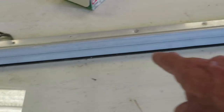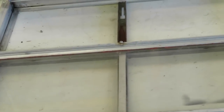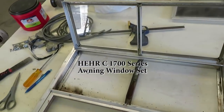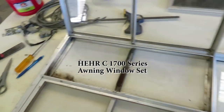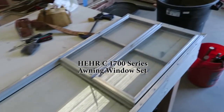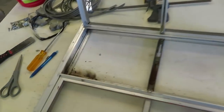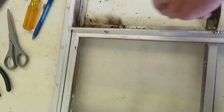The black butyl goes on the metal and then the glass goes on top. I spray some Windex on the other side so I can still move it around and get it centered — it keeps it slippery — and then I go ahead and put the glazing in to hold it in there. These are the awning type windows with solid panes in the middle and awning windows on the sides.